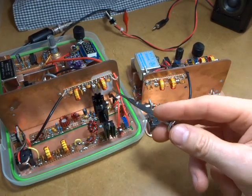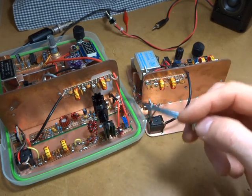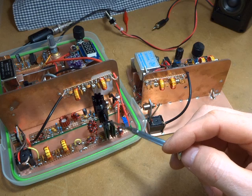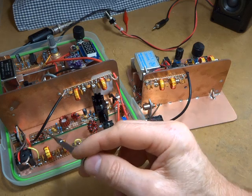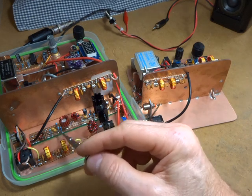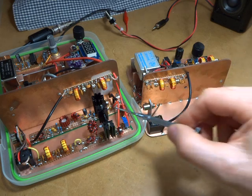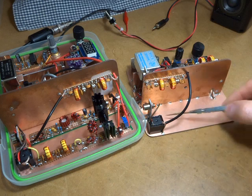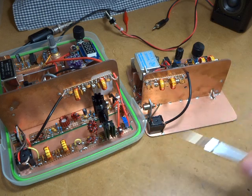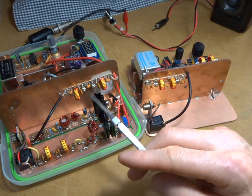I'm pretty sure I can shrink things down. If I was to duplicate this particular circuit — which is an IRF510 for the final and a couple of 2N3053s for the driver — I could see there's quite a bit of blank space here, so I could shrink that down and sit it across here with heaps of room, and sit the low-pass filter sideways. But I'm also thinking about the idea of using a push-pull amplifier.